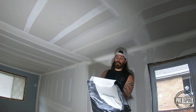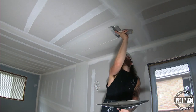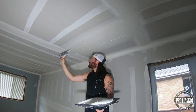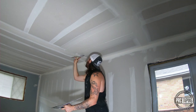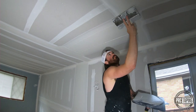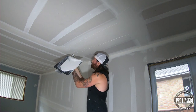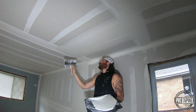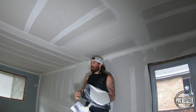I'm going to take a good amount right down the middle and leave that. Now I'm going to put a little bit of mud on each side of the tape — I like to pull the mud and put a little bit on the edge, same on the other side. What that does is tie it in and it covers the joint that's pushing it back out. So now I'm going to run it right down the middle, maybe do it a couple of times depending on if I have a chunk in my mud, then flare the edges and keep going.